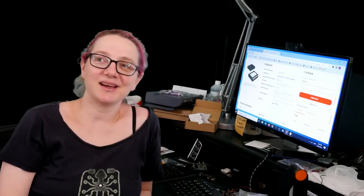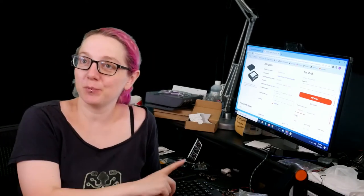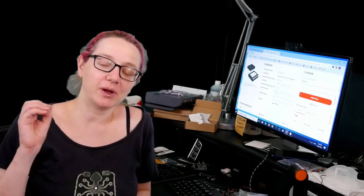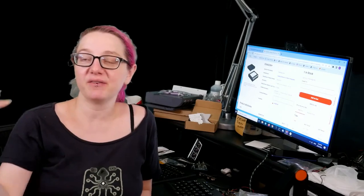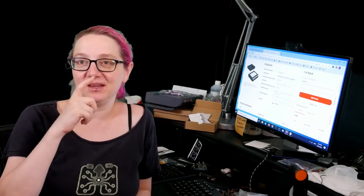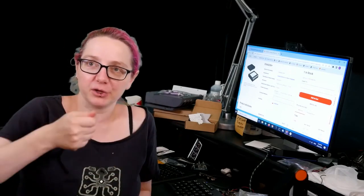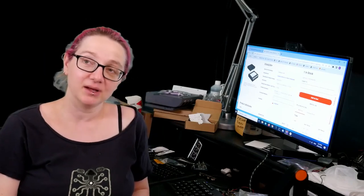I'm glad you asked. This week's Great Search is, I just made a breakout board for the DS4420, which is a really adorable mono audio amplifier with I2C volume control. So it's analog volume. You have analog in, analog out, but in between, you have an I2C level control, which is kind of handy. You don't want to have a volume knob and you don't want to go digital and back out. It's fairly inexpensive.